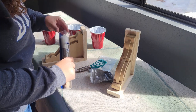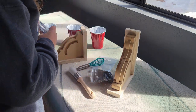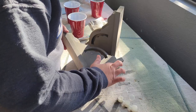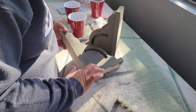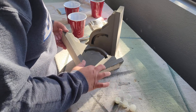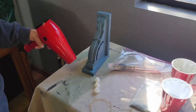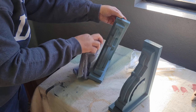Now we're ready to paint. I'm following Jamie's tutorial, which I'll link in the description box. I'm putting the Zinc color on first, then clear wax where I want the second color to chip and crackle — the point is to make these corbels look old. After the clear wax, I paint on the Moody Blue, apply some heat, wet distress, apply more heat, and that's about it.